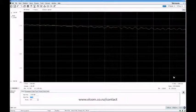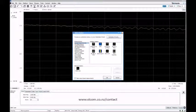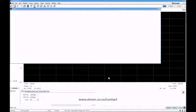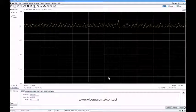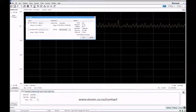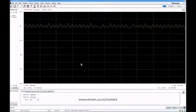So the next one will be a little bit tricky because my antenna I have is really bad, but let's try. We did the cable loss, remove that, and we go to return loss and distance to fault. Same thing here. We start from the beginning again, and here we are at the parameters. If you press this one here, same as usual, you get this kind of settings. And there's a DTF tab with settings: cover distance, limit bandwidth, center frequency, method fast. There's fast, normal, or high res, depending how you want to do it. In this case, the method fast will give me a resolution of 80 millimeters, which is fine for this demo. If you go for high resolution, the resolution will go to 70 millimeters. But in this case, I don't really care, because I don't have good things to test with.